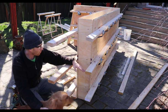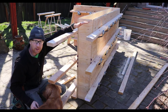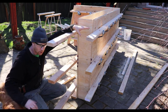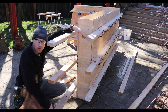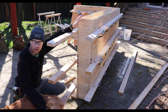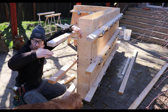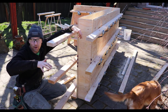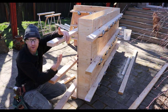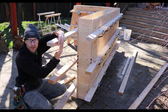So if you were to place the concrete in this form all the way up 4 foot high as a really fast continuous pour, so all of the concrete is still liquid or fluid, you have a lot of force on your forms. So you start getting into an 8 foot, 10 foot high wall like a basement, that's where you start timing your placement. You do lifts of 4 feet, let it sit a little bit, do the next 4 feet, making sure that your first lift and your second lift are still plastic and fluid enough that they can be vibrated and intermingled